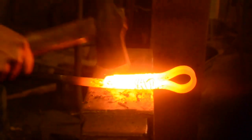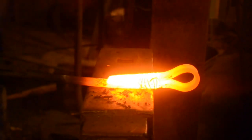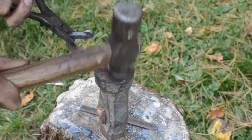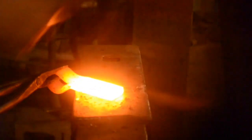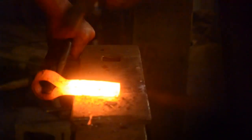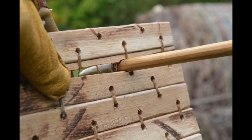So why does grain matter? Because the fundamental structure of the steel is different, the steels will behave differently. The wood-like grain of historical iron causes it to behave like wood under certain circumstances. I've only tried forging it once — this was years and years ago. It was an old wrought iron nail; I was trying to forge it into a hook. I tried to flatten out a section where it would connect to the wall, and the effect was very much like hammering a stick. The metal just frayed and came apart. I remember a conversation with one of the old timers at my blacksmith association, one of the world experts on bloomery iron. He described how, if you were to take a breastplate made out of historical iron and shoot at it with a bow, if the arrow struck perpendicular to the grain it would bounce off because it has to cut through all those fibers, but if the arrow struck parallel to the grain it would split it open like a piece of wood. He was probably being hyperbolic to illustrate a point. Nevertheless, the potential for historical steel to behave in a dramatically different fashion from the modern should not be discounted.